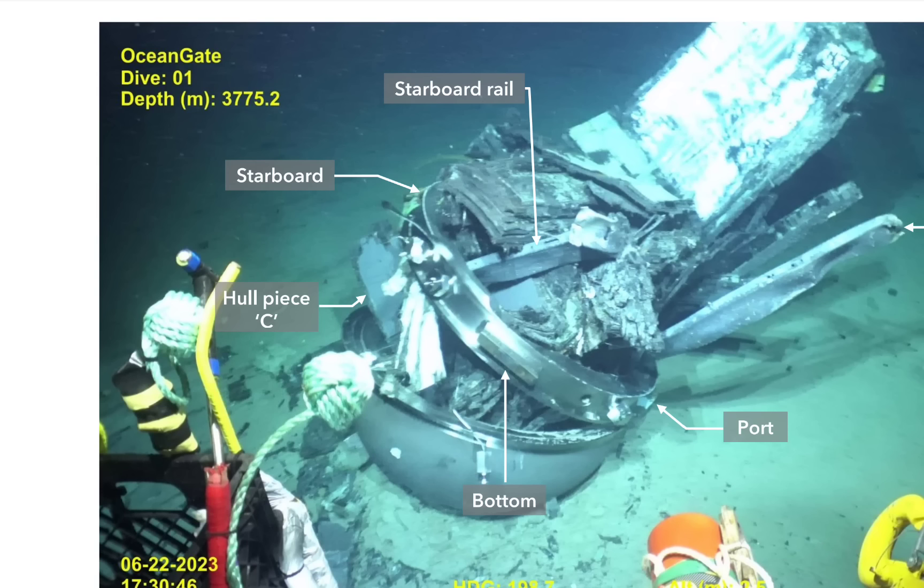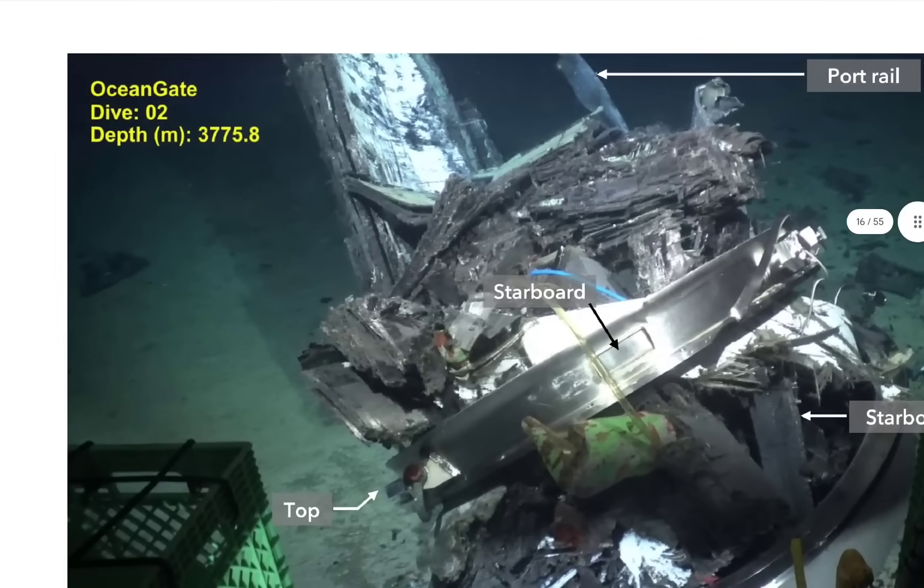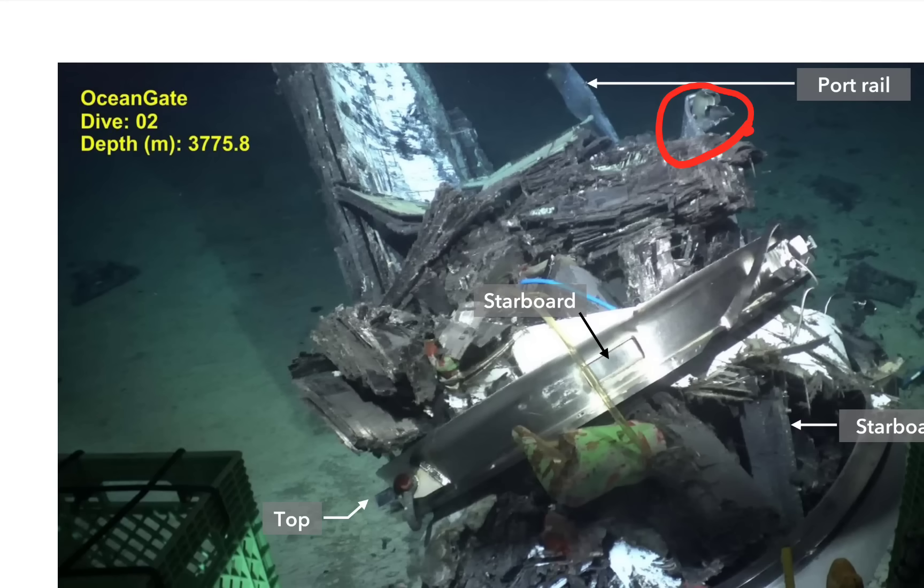I'm extrapolating segments as SGT — they do not identify what SGT means inside the legends anywhere. Legends are how you define your terms, your notes, your definitions. So this was connected — starboard — it was connected here, as we saw in that image right there. There's the bent-up section. I showed you it was connected at the end, but this is where it was connected — that's the weld. So this is a weld failure. You can call it a fracture; I call it a weld failure. This is how the stern drop fell off.